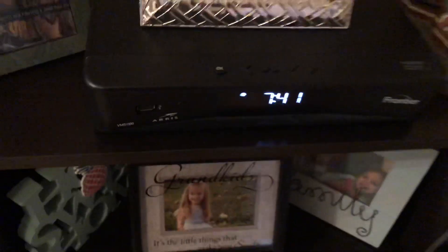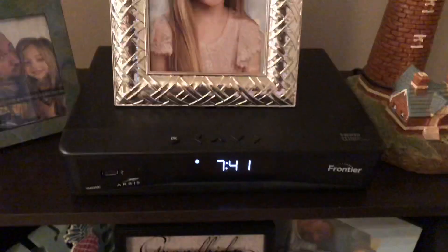They drilled through here and made a nice box. That right there is for cable TV — that's for the cable to go into the modem, which we'll discuss shortly. But I don't even need that cable. This is Frontier's main cable box, but like I said you don't need that for 200 over 200, 500 over 500, or the gig internet. That's why you have the power of ethernet for that now.